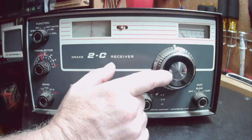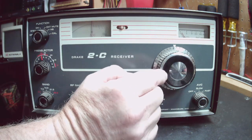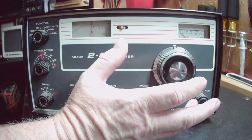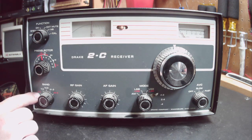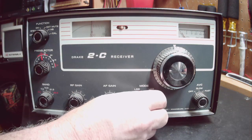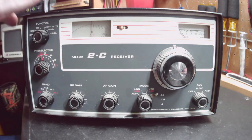The best way to explain this: the VFO is using a set frequency range - I think it's 3.5 to 4 MHz, giving you about 500 kHz of spread. The way the mixing works either adds or subtracts. On the lower bands you're using the lower half of that range; going up you're using the addition in the mixing. So it changes which sideband you're using depending on whether you're adding or subtracting frequencies from the incoming signal in the IF and local oscillator.